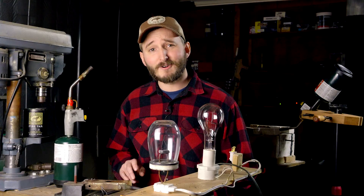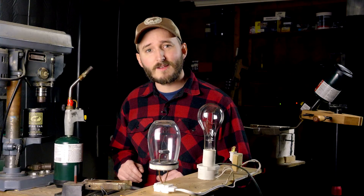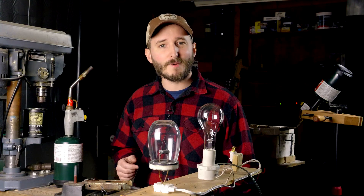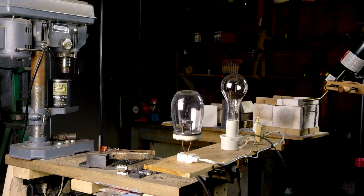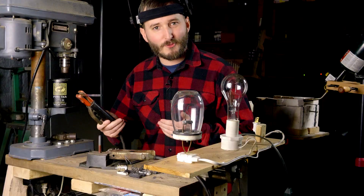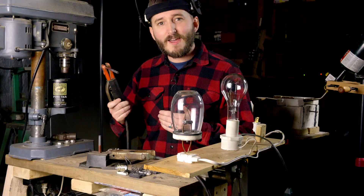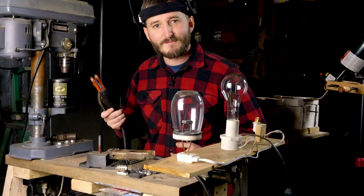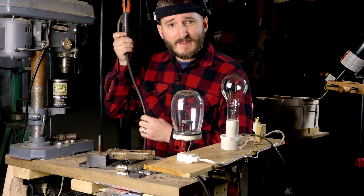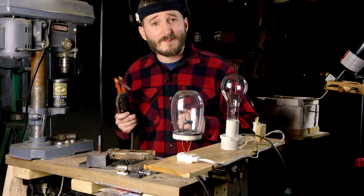So let's try to stay humble in our opinions. Let's look at one type of electric lighting that existed before Edison, before Swan, and before everyone else that experimented with filament-based light bulbs. I have in front of me two carbon rods, used as the material of choice because carbon has the highest temperature resistance of any conductive material known in the 1800s. Attached to these rods by copper wires is a powerful source of electricity — in my case, an electric arc welder. Before Edison, one method of electrical illumination worked like this.